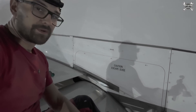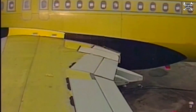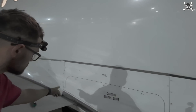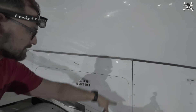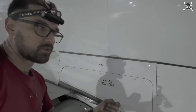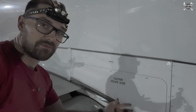This is our off-wing slide, which is going to be inflated whenever you open one of those two emergency over-wing doors. It is held in place by several studs, and inside we can find one connector and a hose through which it is inflated.